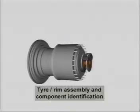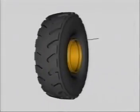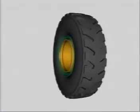We will now reassemble the rims. The first sequence shows the back flange being placed over the inside of the position 4 rim base. The position 4 tyre is then placed over the rim base. The outside flange is then placed over the rim base. The bead seat band is placed in position. And finally, the lock ring for position 4 rim base is placed in its gutter. The assembly of position 3 rim components and tyre is a reverse image of the assembly that was shown for position 4.